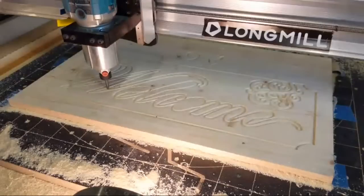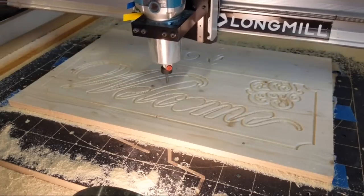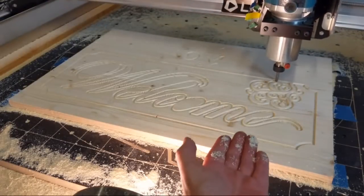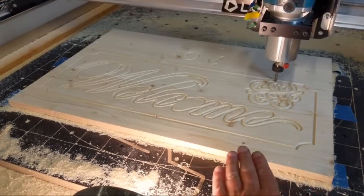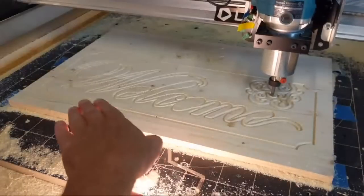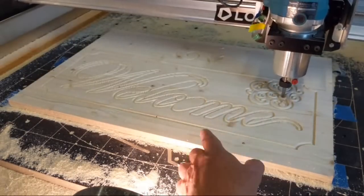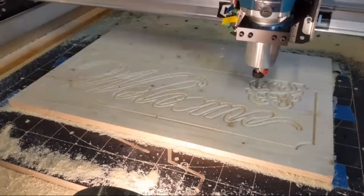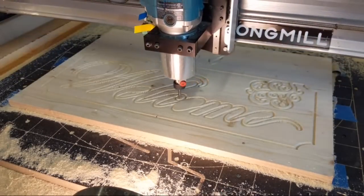See how this thing's going all over the place, touching a bunch of places. You can't work that out. It's Vectric. So the reason it does that is because it's stepping down incrementally to clean things out, and it's coming down to certain levels. And so it cleans everything out at those levels, and then it's got to go to the next level, and so it bounces all over again until it gets to the bottom of every V-carve. So it's a total pain in the butt, but you can't stop it because it's the way Vectric is written.